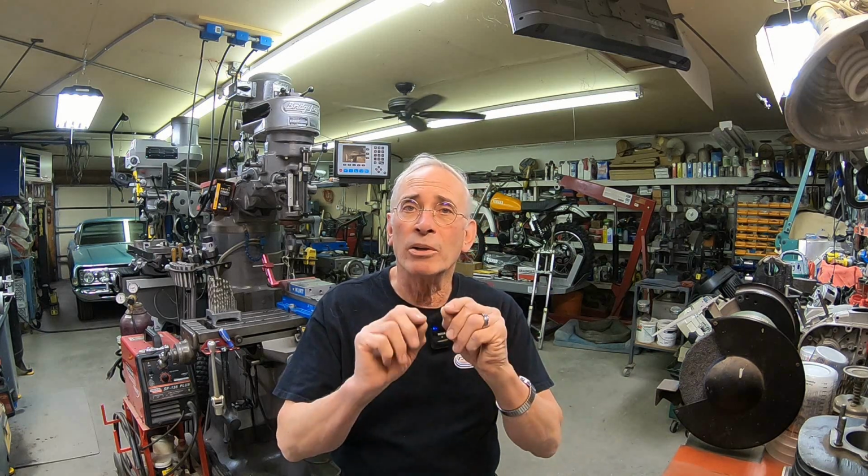It does start to wet just like aluminum does, if you've ever done that, and you've got to be really right on top of it or it'll drop out on you. That's the only thing. You just got to creep up on the temperature, and it seems like you start adding rod a little bit earlier than you do aluminum, and primarily that's because you're trying to cool it down by getting the rod in there so it doesn't drop out on you.